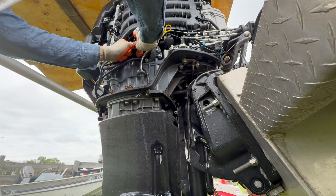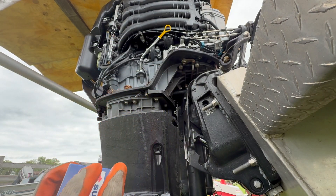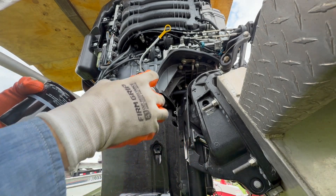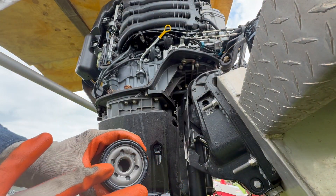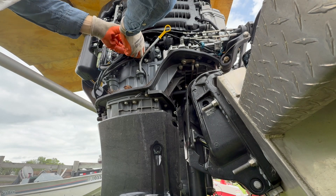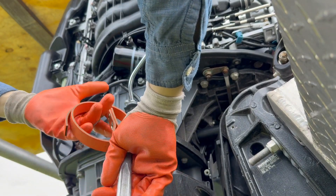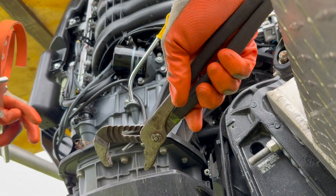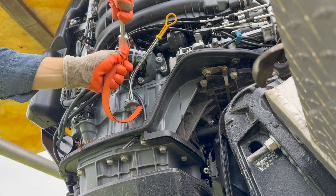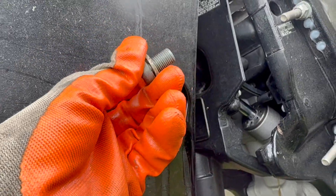You definitely don't want to use channel locks when you put the filter back on. Get your Suzuki oil filter — this is the part number right on there, for a Suzuki 150 outboard, I believe it's a 2023. Make sure you take off the plastic, get a little bit of oil from the old filter on your finger, and put some oil on the new seal of the new filter. Stick it on there and get it lined up straight, otherwise it won't go on. Once it's hand tight, get a band-style filter removal tool — don't use one with teeth or channel locks because you could puncture a hole and make a big mess. Just get it snug, you don't need to crank it.